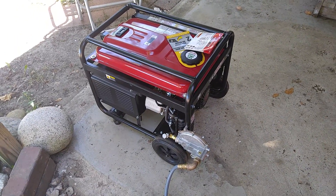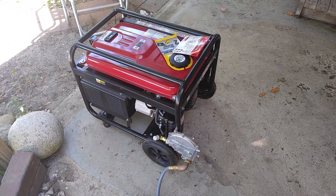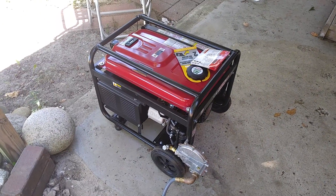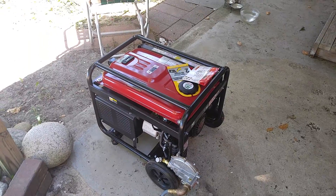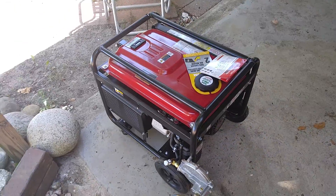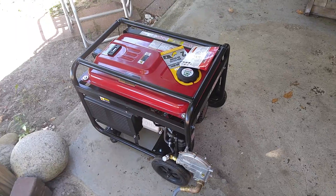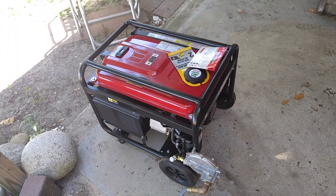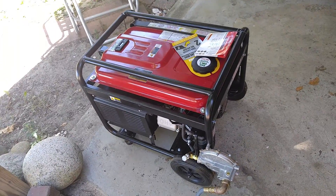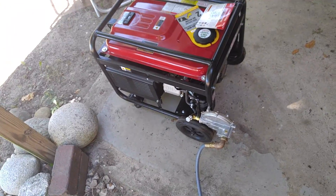The more air and fuel you can get through the engine, the more horsepower you'll get out of it. I loaded it with a toaster and a heater and it would not continue to run at the highest load — when I get close to 3,000 watts, it loads the generator so much that it dies. I'm sure it would work fine with gasoline. I realize that natural gas has less energy, but it'd be nice if I didn't have to run the choke halfway. That's the issue I'm having.